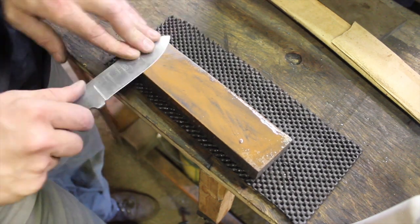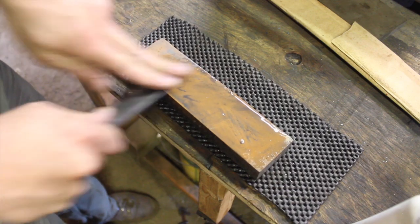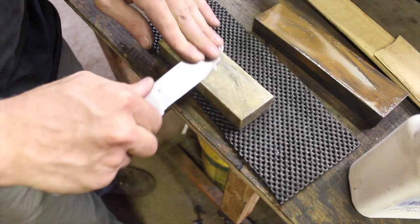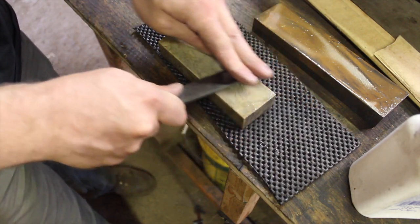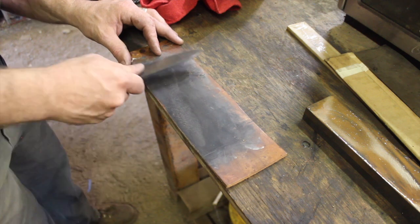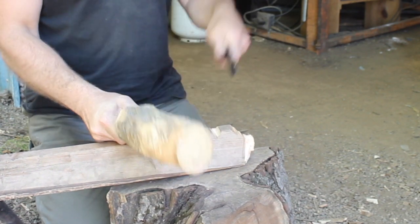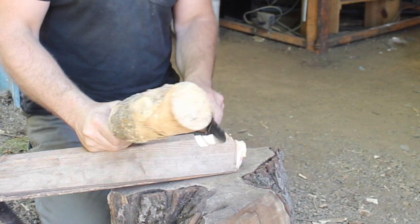This is my wet stone, or oil stone as it were. Just refining that primary bevel right there, taking the burr from the grinder off and smoothing it up. Then I'll get it on the Arkansas stone once I have that well established — the Arkansas stone is close to honing. It puts a nice edge on it, and I follow up by stropping, which is the final step. Stropping is especially recommended for blades used for carving or working wood, because at the microscopic level when you take your edge to a sharpening stone it's very rough with unsupported burrs. If you take it to the strop and polish it down to one mono edge, it's much stronger, cuts better in the wood, and lasts longer.